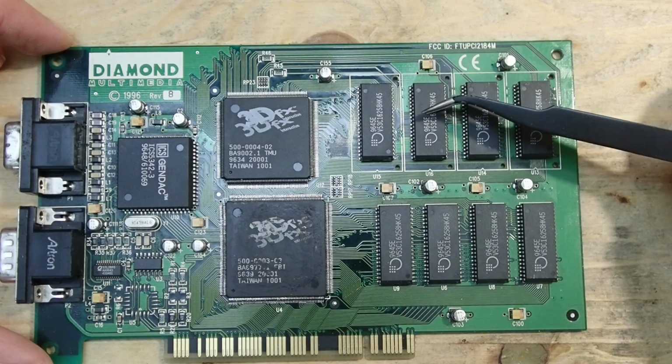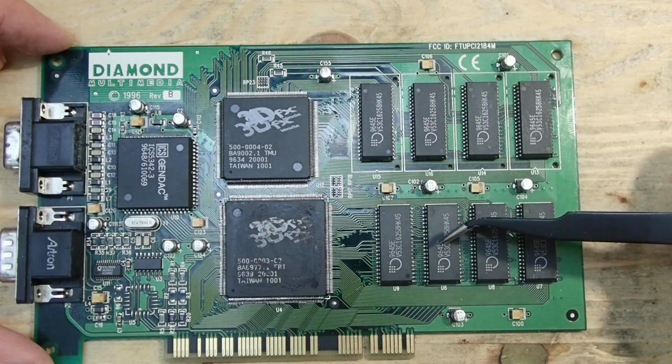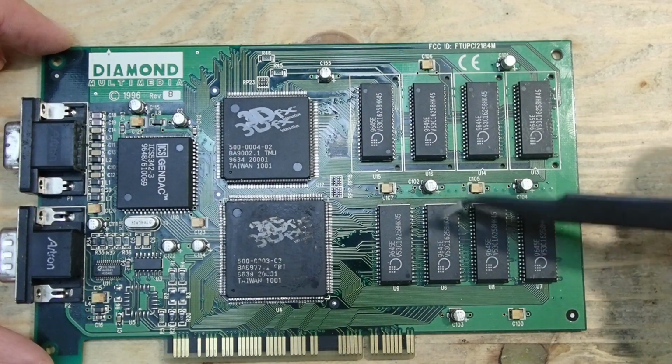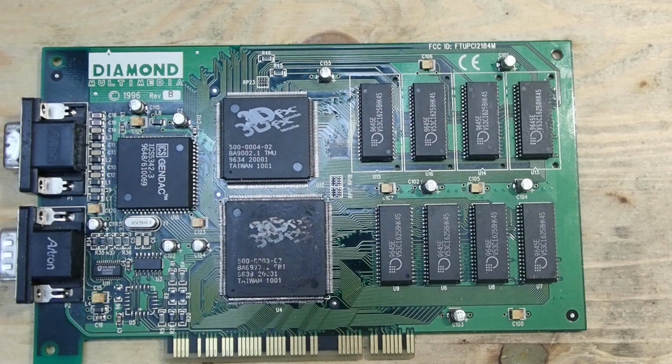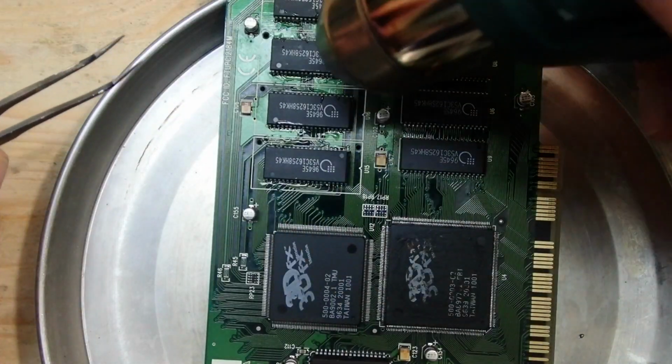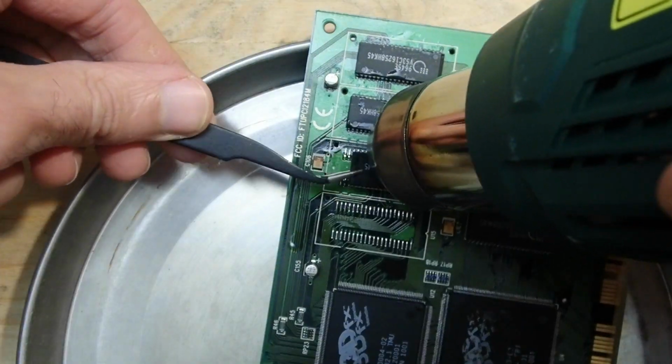Unfortunately, I have no spare memory which would fit into this Voodoo card, but I have a donor. The other Diamond Monster 3D with the damaged frame buffer interface can give us a bunch of memory ICs. I don't know if they work, but well, what do we lose? So let's try. I guess I'll try to replace only the texture memory and leave the frame buffer memory in place for now, just to see if it makes any difference.